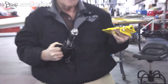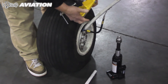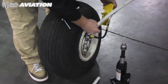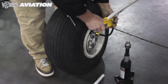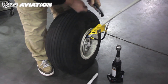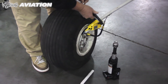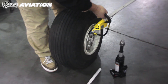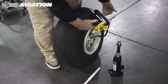Now that you've seen the pad, let's put it on the aircraft. We're going to install the 30M-FPP jack head on the landing gear of the Cessna 185 — just thread it in here and get it to fit on the gear. Then we're going to add a C-clamp to the gear to hold it in place. The C-clamp is an important safety factor, particularly on gear like the Cessna 180 and 185 where the angle of the gear is extremely steep.